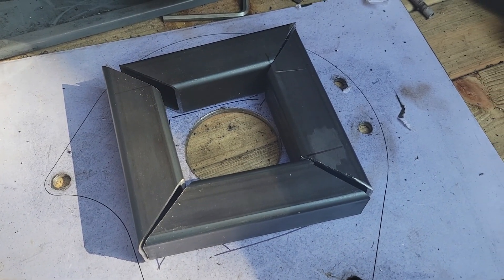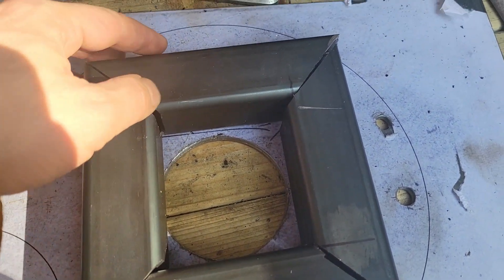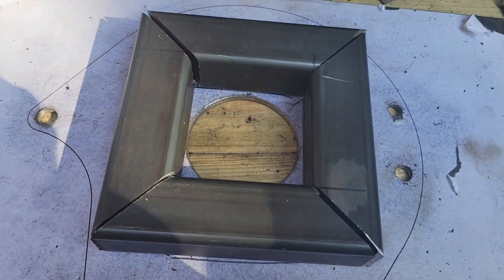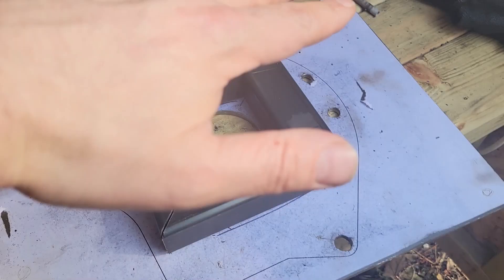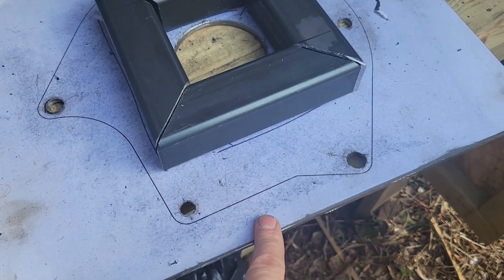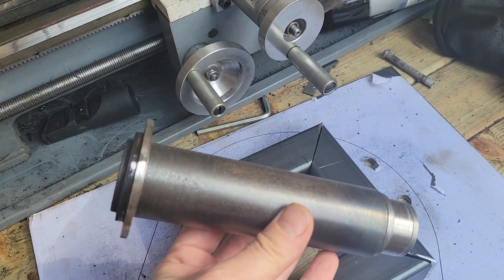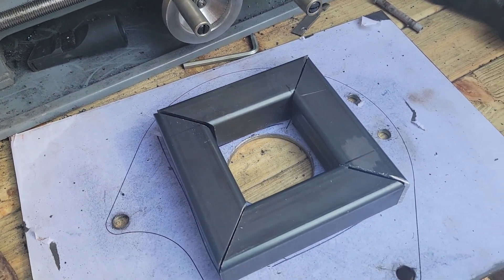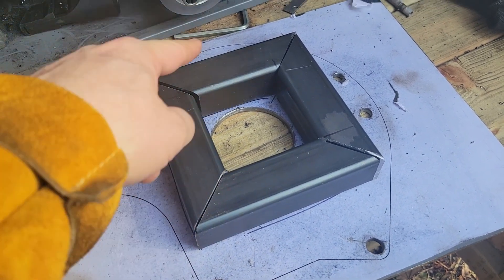Four nicely even pieces cut — a little bit of tidying up needed, but those can make my box around this hole. And then this other piece sits on the top. So all together we have 40mm, two 6mm plates, giving 52mm separation, which is what gives us the calculation for how long the coupler needs to be. I'm not 100% confident in that, so it'll be good to get it all together and test it out.